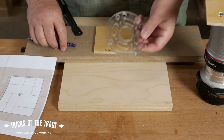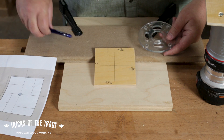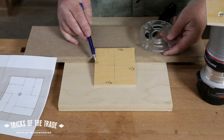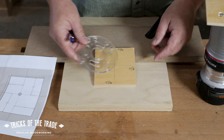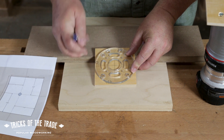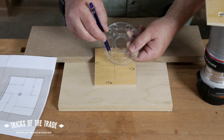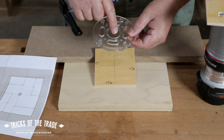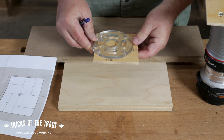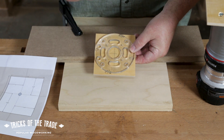To make it: take the plate off of the router, cut your board to size, and find your center. For the smaller one, measure two inches over and make a mark, then two and a sixteenth down and make a mark — that's your new center location. Place your plate on there to locate your holes. Make sure you're working from the right side of the base; on this one the holes are recessed flush, so this is the down side of the plate. Locate it correctly, find your center, make your marks, and drill your holes.